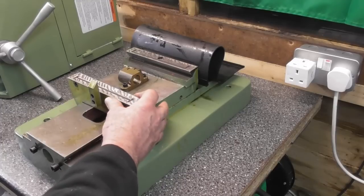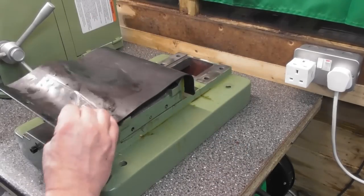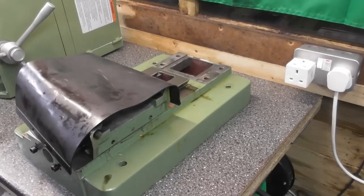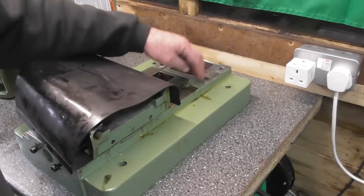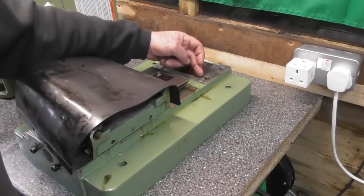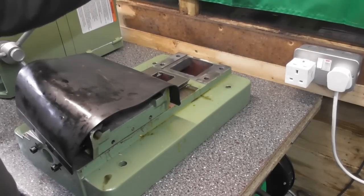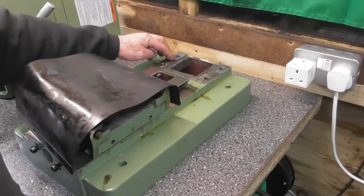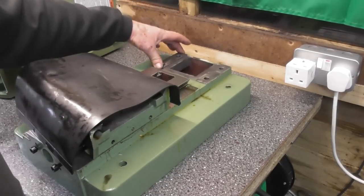I haven't got the gib screws yet — it's tapered gibs, which I do like far better than the adjusting grub screws that you see on a lot of cheap Chinese lathes. This is the rear way guard. Where the column fits is interesting — you can see it's a machined face where the column sits on these two pads. This end appears to have been linished, maybe with a fine sander, along half its length — most likely to correct the angle of the head to make sure it's 90 degrees.